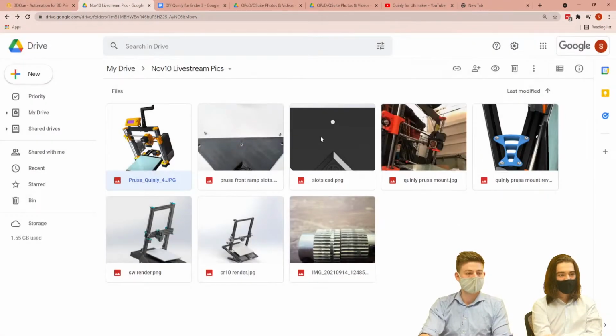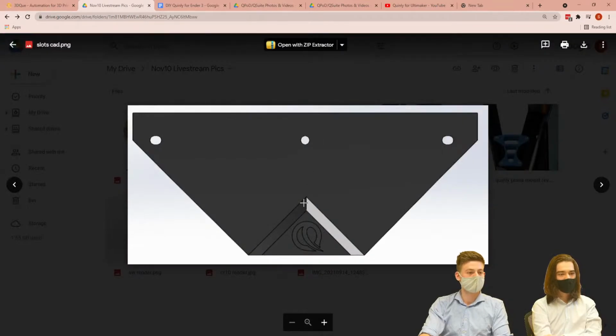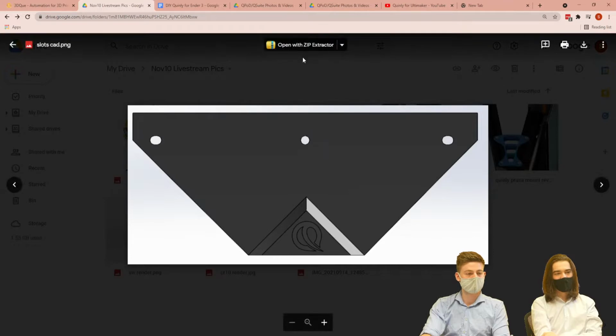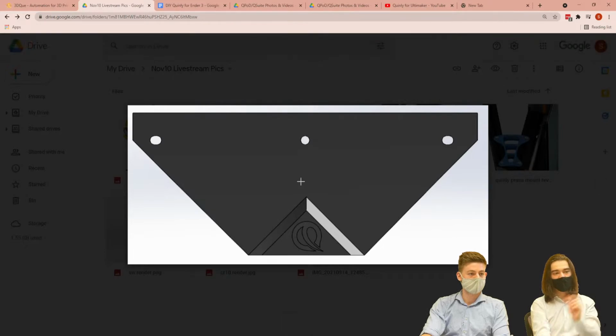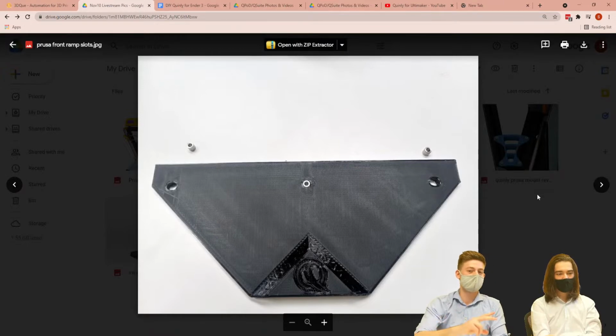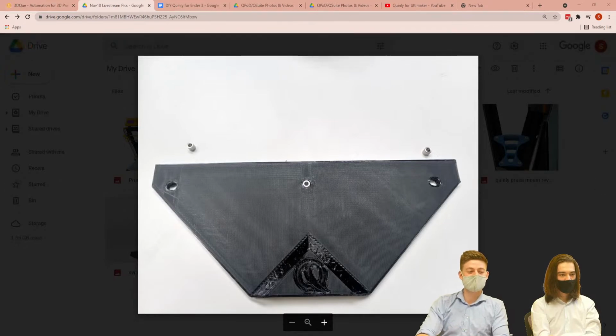So what we figured out was this design, which is just a slight raised area on the front of the ramp. Under most circumstances, if it's a big part, the part just goes straight over it. But if it's a really small part, like the ones that we have issues with, those will actually slide down and deflect off towards the side of the printer so that it doesn't get caught in the printer's belt. And actually, during our stream, there's some background footage where you'll see some parts get deflected by this ramp. Some of the shots are pretty cool too. There's a trick shot one which I really like.